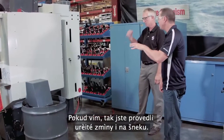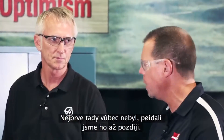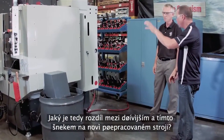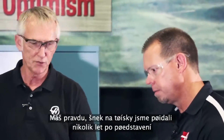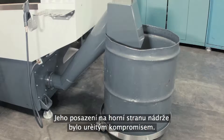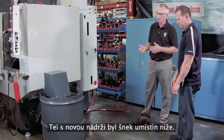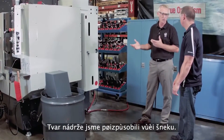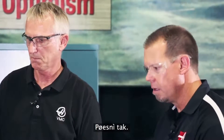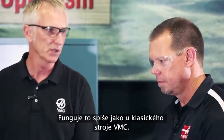You guys made some changes to the auger. A little bit of history: at first we didn't have it, then we added the auger — so what's different on the newly redesigned machine? We added the auger a few years after the introduction of the Mini-Mill — it was kind of a compromise, it sat on top of the tank. With the new tank, we've actually got the auger lower down in the coolant a little. We shaped the tank for the auger, so the machine was designed around the auger. It does a much better job of getting the chips out of the machine — it's more like a regular vertical in that respect.